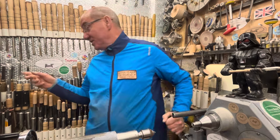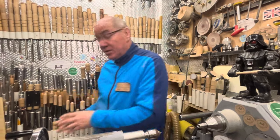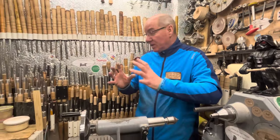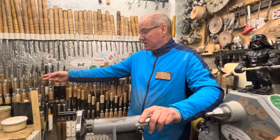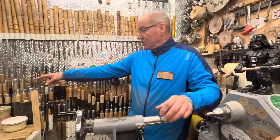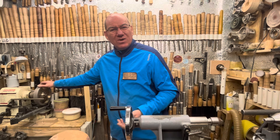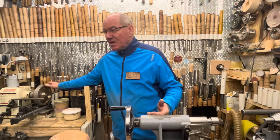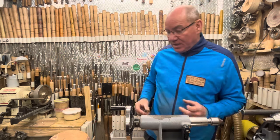Right, well, for my arbors, I stripped down my old grinder. Now, a good thing if you do want an arbor and you're not into using a nut and a bolt and all that: go to the boot fairs. You see grinders. It doesn't matter, as long as it's got the same arbor. Most of these will go to a 15 point something. I think it's 15 mil or 16 mil arbor. The smaller ones tend to be half inch or 12 mil, depending on what you buy.